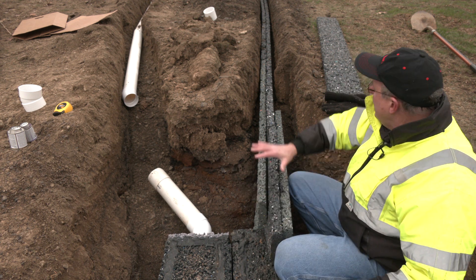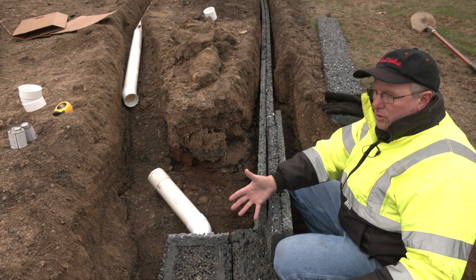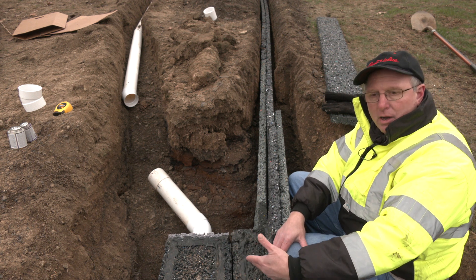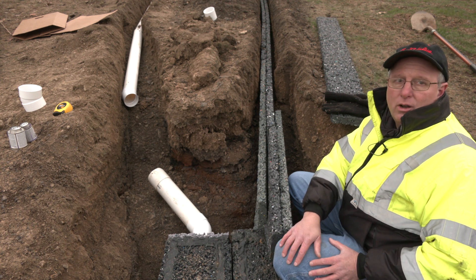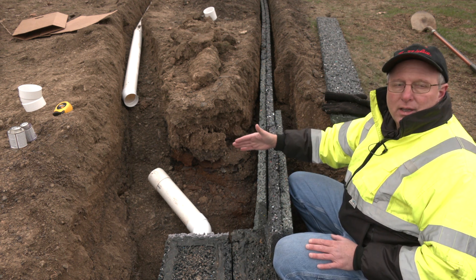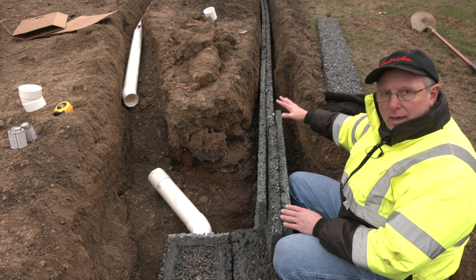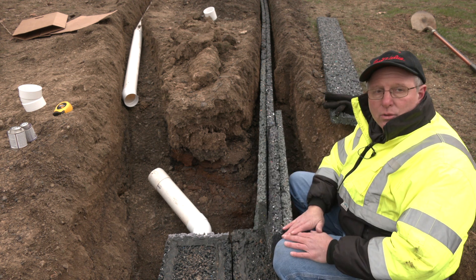This system is designed to take water from the yard and from the downspouts, filling into the stormwater box. When it stops raining and the yard dries up, the water will permeate back out of the boxes — as the ground dries, it accepts the water back from the boxes into the ground itself. We'll also show you our safety pop-up valve, just in case we get four inches of rain in a couple of hours and it overfills. Any time you're doing a HydroBlock job, you have some stub boards, some extra pieces, and that's how we connect those extra boards around here to the stormwater boxes.